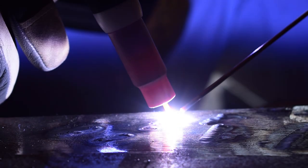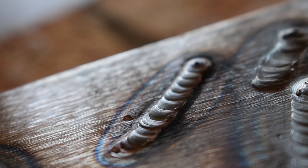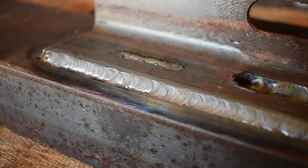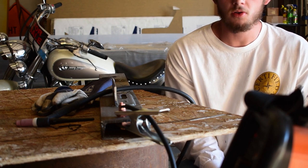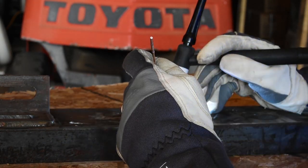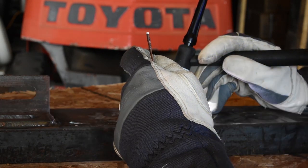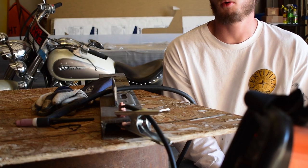I can only think of three reasons why you wouldn't want to buy this welder. Number one, if you need to weld with more than 130 or 165 amps, as these are the limitations, which also ties into the duty cycle depending on how much you're welding. Two, if you want a welder with more pulse control — this pulse is set-and-forget; you cannot control the parameters within it, one parameter only. Three, if you want to weld aluminum or anything requiring AC welding — this is a DC welder only, which is fine for steel, stainless, etc., but will not work for aluminum.